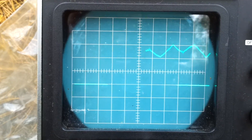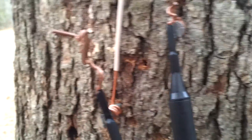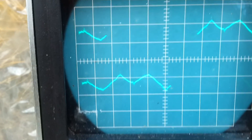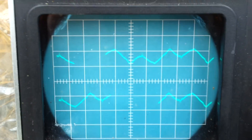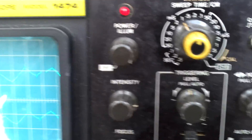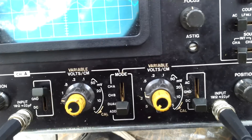Let's try channel B. Here's channel B — we'll put it on the third wire. You've got the volt-ohm meter, which is still reading 1.087 volts. You've got channel A, and this is channel B. Channel B is looking pretty much like channel A. We're still at 1 millisecond. Channel A is AC, channel B is DC.